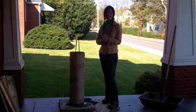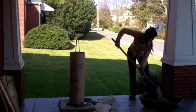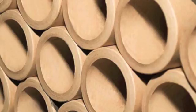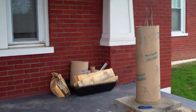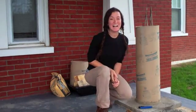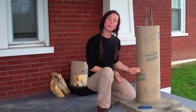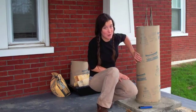So that being said, let's go ahead and form our column. It's been three days — although our concrete isn't fully cured yet, we'll need to remove our Sonotube cardboard form. Although it's three days for Sonotubes before they need to be removed, it may be different for different manufacturers, so just double-check on that to make sure you don't have your cardboard form permanently adhered to your column.